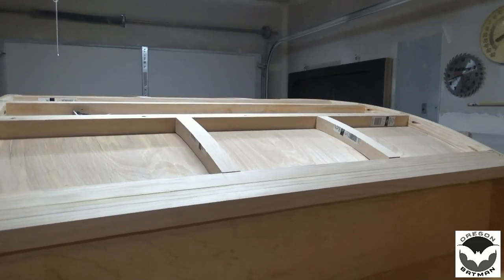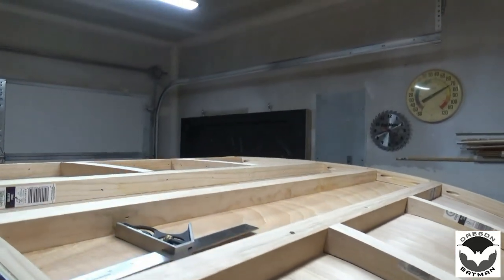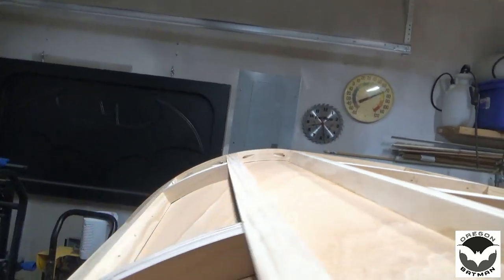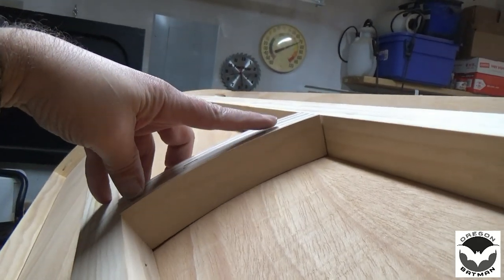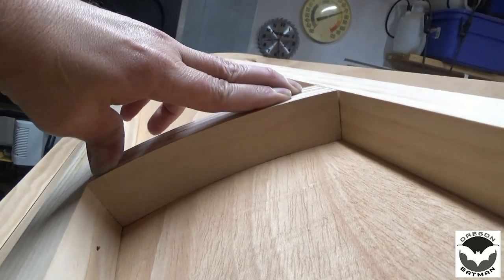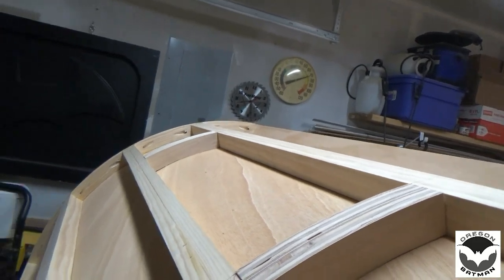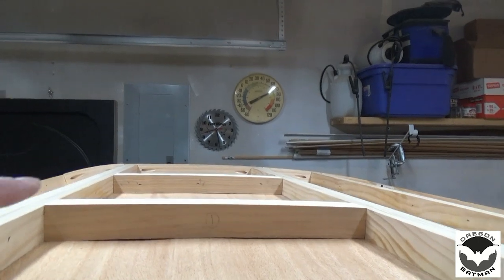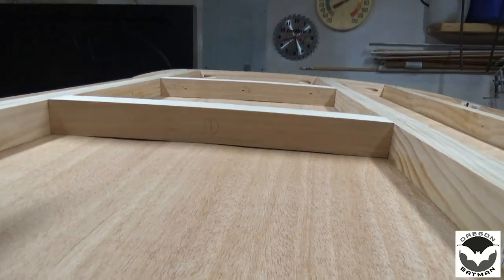All right, so what I've been doing is cutting my braces for the back section. I cut my braces here for our exhaust fan, and I cut a couple braces here for the front. And then when we get ready to fasten that, it'll seal nice and solid, and it'll help push this down and make the inside flush. So, next step is to get some adhesive contact cement under here. That way it'll close up the gaps that we have.